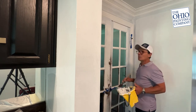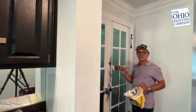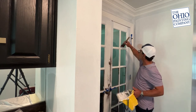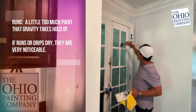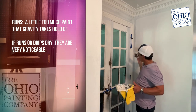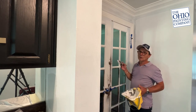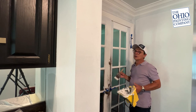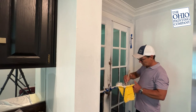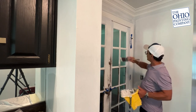One key thing to remember is once you've finished a door, go on to the next one and do that. But once you're finished with that door, come back here and check these runs, because they're gonna be there. I promise. Just look for them, you'll find them. You want to make sure you're putting enough paint on there, but you don't want to overkill it. Normally whenever you're putting enough paint on there, somewhere we're gonna get a drip. That's a lot of paint brushing right there. Getting all that squared out is scary. Once again, I've got this done — I've gone all the way down now.